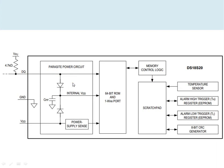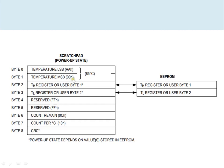This is the internal configuration of the DS18S20 sensor. It has a scratch pad which stores the temperature data, and it also has a facility to store user alarm settings. The user can set a temperature threshold so that when the temperature reaches a particular limit, the sensor can be used for triggering an event. The scratch pad has a total of nine bytes: the first two bytes represent temperature data and the next two bytes represent the alarm settings.